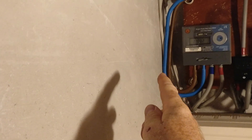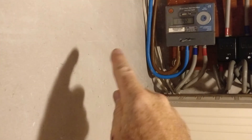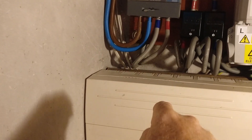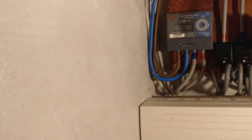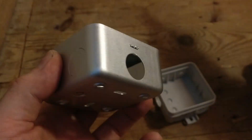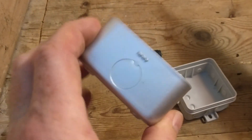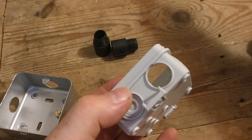It's going to be difficult to film because this cupboard is so tiny. I'll do it in stages and come back to show progress. First I'll mount the two boxes, then run two pieces of conduit down to the back of the consumer unit — it's mounted about an inch from the wall so there's space behind it. Before screwing boxes to the wall, knock out the blanking plates that are pre-cut by using a screwdriver and hammer to push them out.